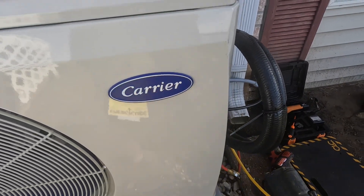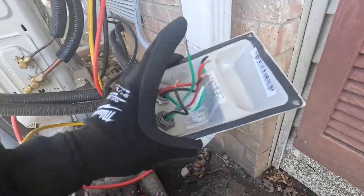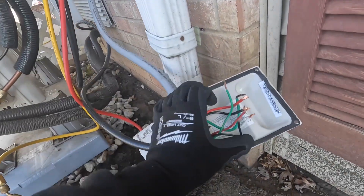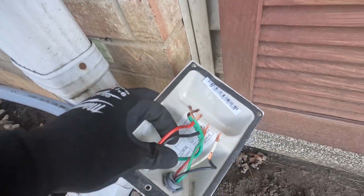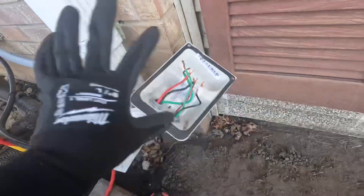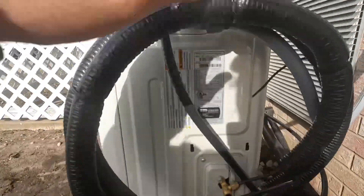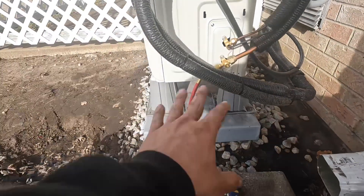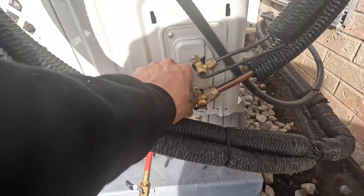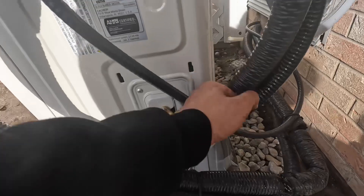It's on the pump. My plan is to just put this back on there - it's going to be pretty tough getting all these wires on there with how short it is. But it would save me a lot of time if I didn't have to take these off and re-put the plate on. We're wired up and we got a good vacuum pulled. I'm leaving my ball valve on until I open the charge - that way we don't lose any vacuum. Because if we take this off right now we'll hear a psst, and that is technically losing a little bit of vacuum and letting atmosphere in. So we're going to open the charge first, then we'll take that off.